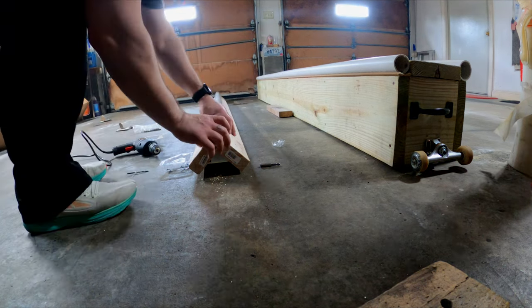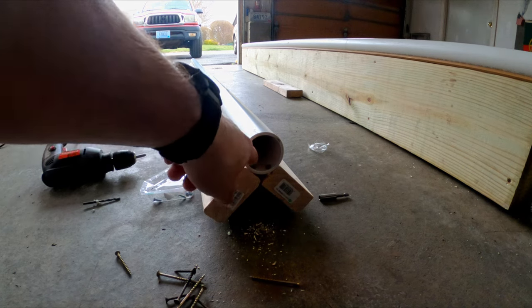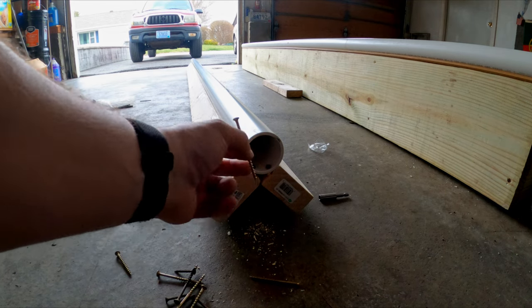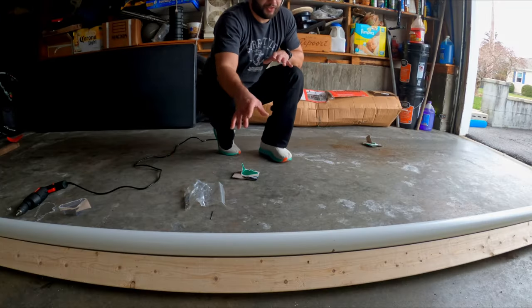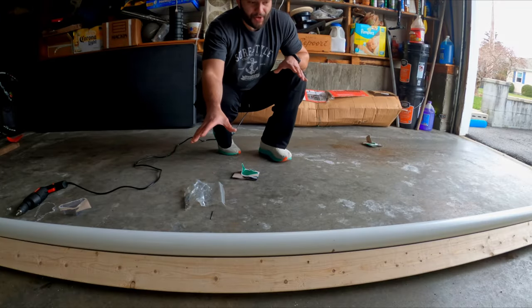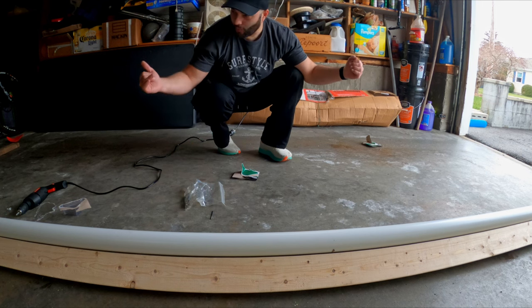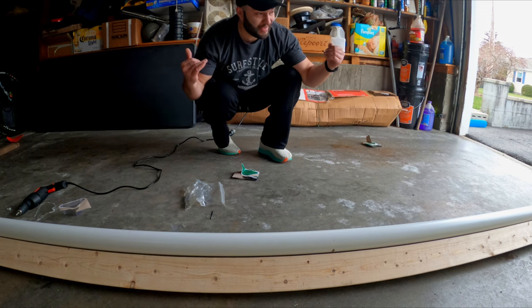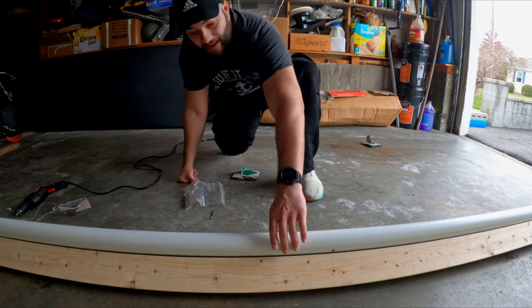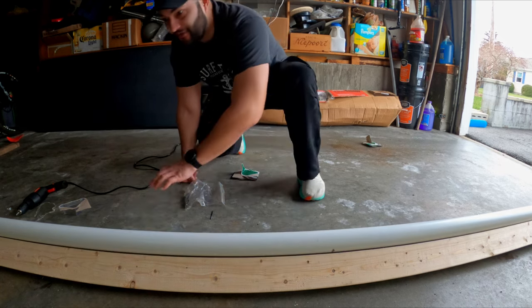Just like that, then take your wood screws and screw them right in. I just drilled in two wood screws through there — I'm going to show the whole process again after I do the middle. The reason you want to fasten in the middle first is because you want the PVC to be stretched out. If you do one end then the other end, sometimes you can push the sides of the PVC in and it bows upward. Make sure this thing is fastened down.